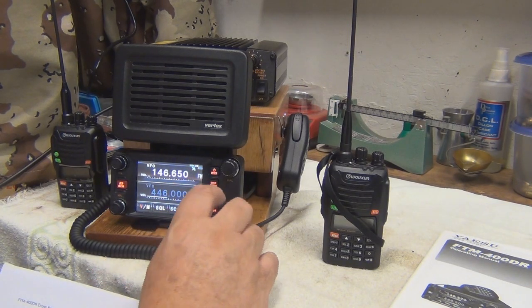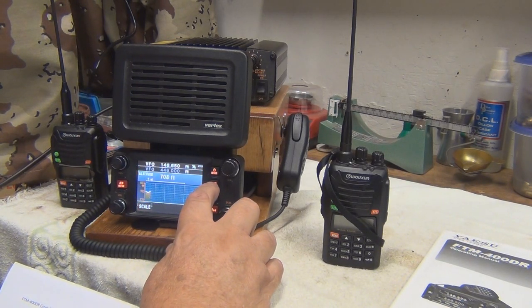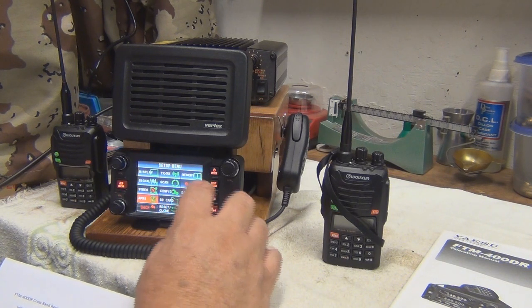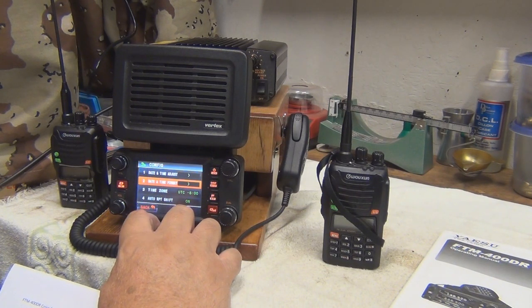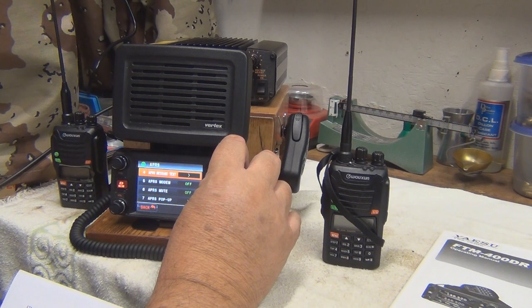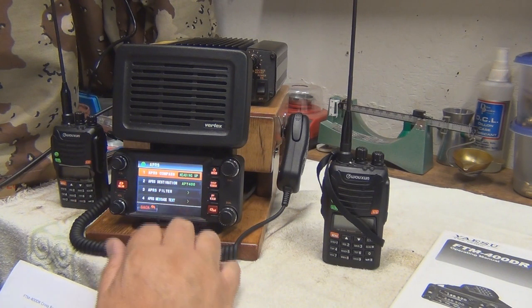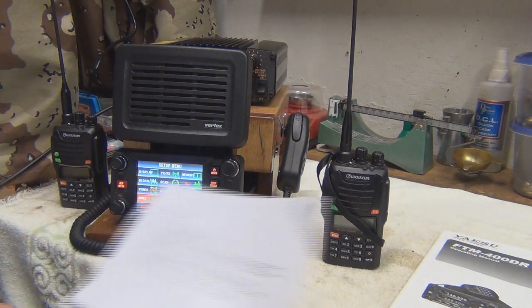You also have to have APRS mode set to OFF. I'll get back to the right screen — press and hold for a couple of seconds, and it's in the CONFIG menu. There it is: APRS mode. This needs to be OFF. Everything here has to be OFF to make this work correctly. Once that's OFF on this particular radio, you can go ahead and start your crossband repeat.